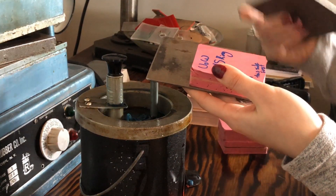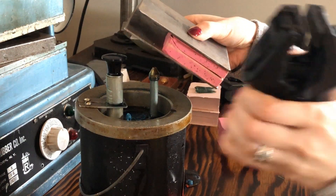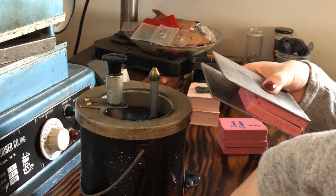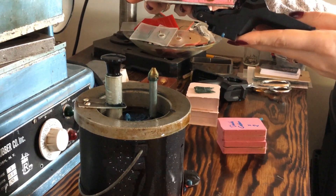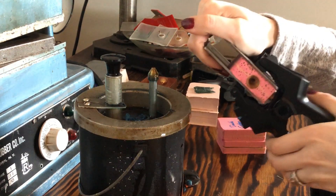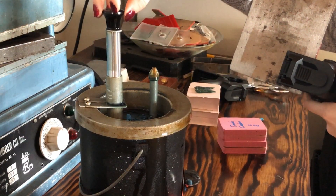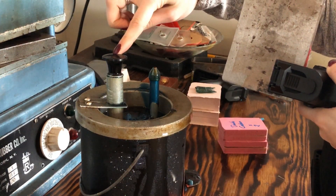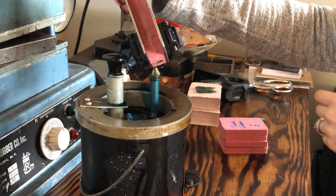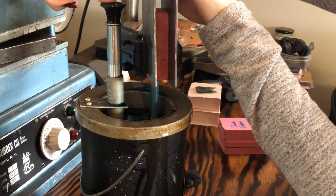Let's get into doing our first injection. We're taking a plate and putting one on the top and bottom of the mold. We're using a clamp with parallel jaws so we can get a nice accurate and even pressure all the way along. I have to do it on the table because these clamps are a bit tough — they're actually from an old GoPro, but there are specific clamps out there for this setup. I'm purging the wax currently in the pump so I can get slightly hotter wax to inject.